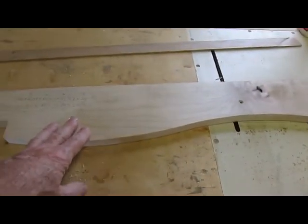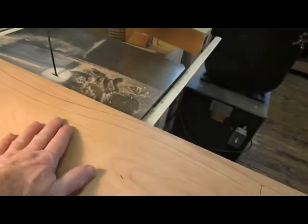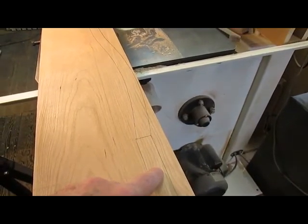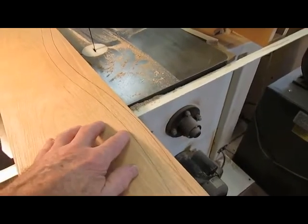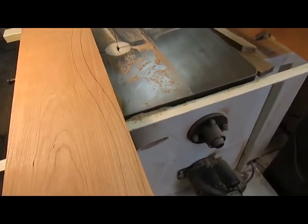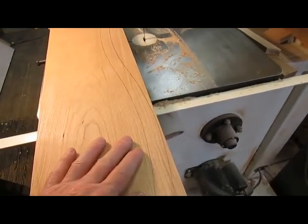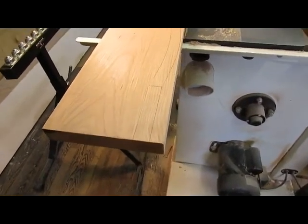Here's our template that was used for the bottom and all the drawer blades and so forth. I took that and traced it onto a board. This is an inch and an eighth piece of cherry. You can see here the markings — this is 7/8ths of an inch wide, and the board is an inch and an eighth thick. I have the front mark on here as well as the back, because it's easier to mark now while the board is square. I'll cut it out on the bandsaw and then smooth it over with a flush trim bit and the template, and then we'll start to make multiple passes on the router to hollow out the curve on the front.